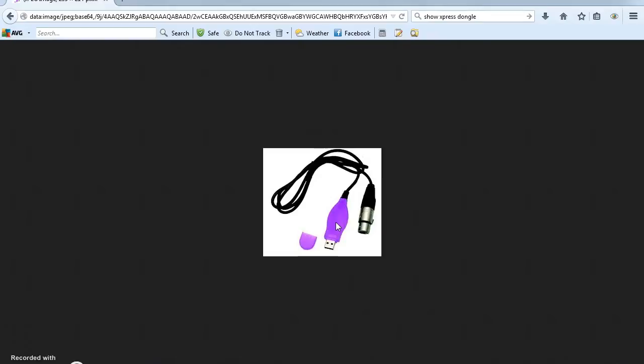You can get 100 fixtures as long as they're all on their own channel. Channel 1's 30 of your par lightings. Then you go into your next channel, 40 of your, let's just say American DJ or Chauvet 4 bars on their own individual channel. You can still get it to work with just this Chauvet ShowXpress DMX dongle. It doesn't matter. It still works fine.